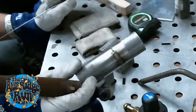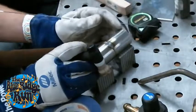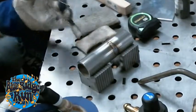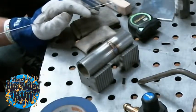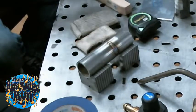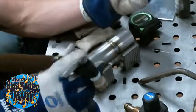Oh, yeah. And again, it's playing with this because there's default settings. I'm not sure if you have to have it ramped at 100% of your amperage for it to pulse properly. I think it kind of backs off, and as you let off the pedal, it doesn't pulse how it should. So the better you can dial the machine in... So pulsing, definitely pedal mashed. It just depends, because if you move the pedal while you're pulsing, it tapers off. With my machine, you can set the duration of the high pulse and the drop, say for 16 gauge stuff. If you go, this is 50%, so it'll go from 100 amps to 50 amps.